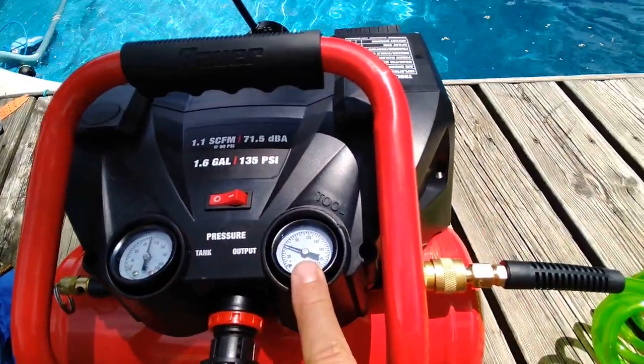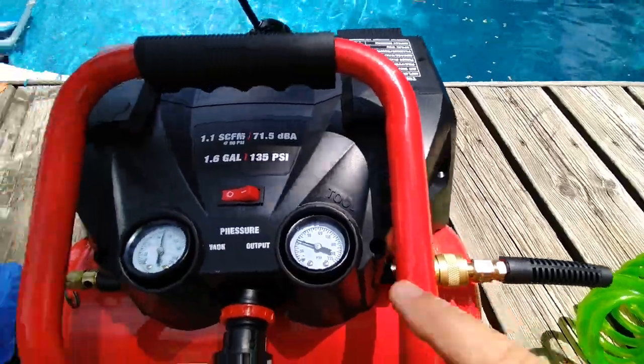We're going to ratchet the output side down to 3 atmospheres. Why 3 atmospheres? In diving at the surface, you got 1 atmosphere of pressure. You go down 10 meters, that's 30 feet, that's 2 atmospheres of pressure. You go down another 30 feet, that's 3 atmospheres of pressure. That's all you're ever going to need. 15 psi roughly in an atmosphere, 15, 15, 15, 45 psi.